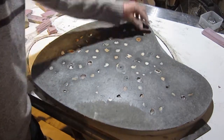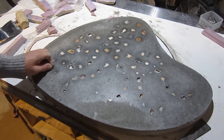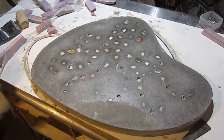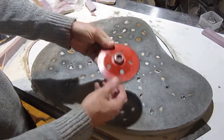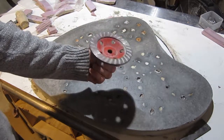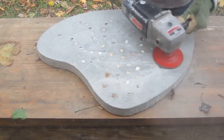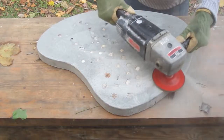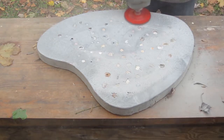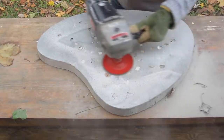Otherwise it looks about right - it's got quite a nice finish on it, even just unpolished. So yeah, this should be interesting. Next step is to grind this down with a diamond embedded piece of steel on a grinder, and we're just going to grind the surface off until we start to reveal our impressions. As much as I hate to do this, we're going to have to split this into part one and part two. In part two, I'm going to grind off the top surface, then polish it up, densify it, and polish it up even higher. So if you're interested in how that all works out, please come back - I am too, because I haven't seen it either. Grab yourself a 2-4 and kick back for a while. Thanks for watching. Cheers.